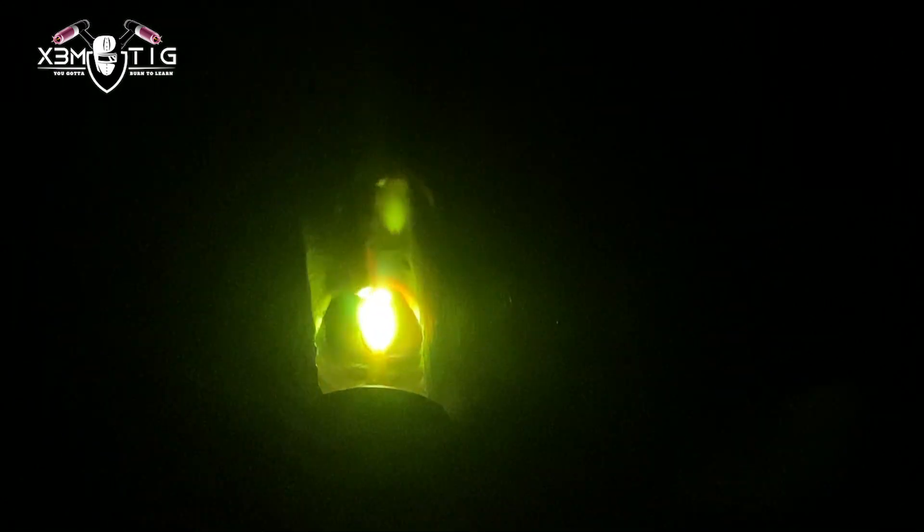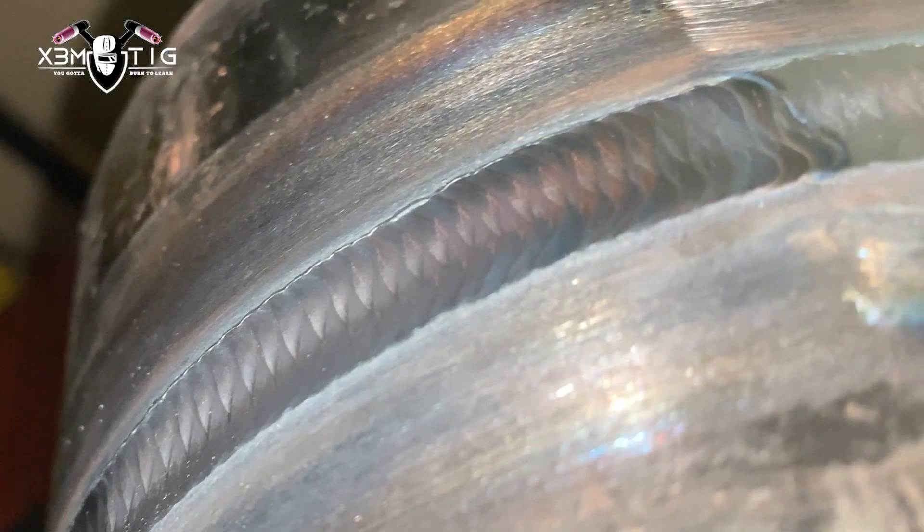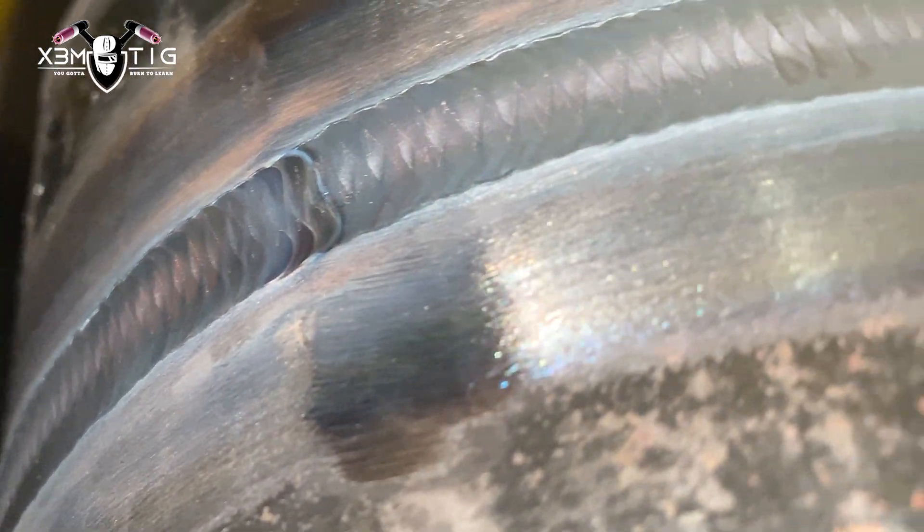Same amperage for this pass — 140. The whole idea is to make sure you stretch both sides. Don't pass that edge, just stay inside and keep that rod in the middle. Push as needed and you can see the amount you actually need inside to make it flush, to make it flat — you don't want any build-ups. That's why good amperage, good settings, nice and clean equipment — that's it. This is filler to flush.